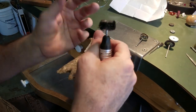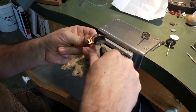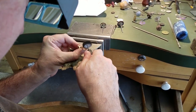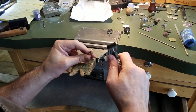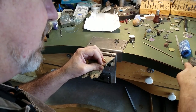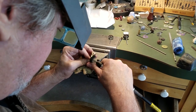Never put your finger through the ring. Never hold it in a way that the buffing wheel can grab your finger and hurt you. If the buffing wheel catches, you want the ring to fly — it's better than tearing up your hand. We're going to go over our flat surfaces with this, and it's going to take a few minutes — I'll probably spend 30 minutes doing this. You don't want to push too hard and deform the piece; you want to let the edges of the buff work. Just add a little compound every now and then, and don't get so much compound that you get a layer of it in there, because then you actually stop polishing the metal.